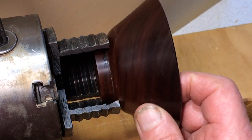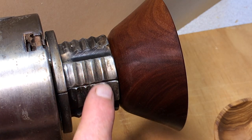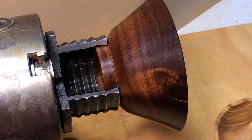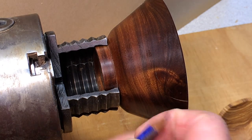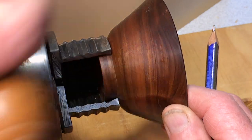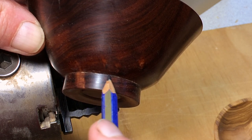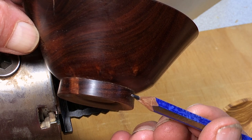Here is a straight foot. This is right on the limits of the chuck, and you can actually see space under the whole jaw, which means the bearing surface is in the middle of the jaw. Any bruising is very difficult to spot even if you know what you're looking for. I can just mark the middle of the foot with a pencil mark — and you would be hard pushed to know that this has come finished straight out of a chuck.